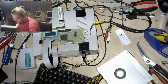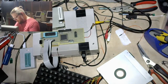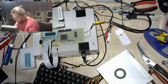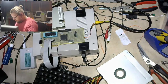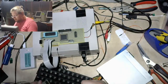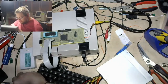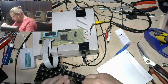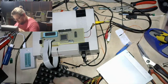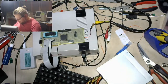God knows how long, because if you're not in a clean room environment, you are definitely introducing particulates into the interior of the drive, where usually the air is super clean and filtered. But when you have a drive that doesn't work at all, the fact that you can do that, and I hear reports of it lasting decently long enough, is interesting. But anyway, I have some of those, and I don't know if that's the issue with some of the ones that I have, but it's worth a try. Worth at least cracking them open. But I gotta buy a Torx bit set, which I don't have. Of course I would have some Torx bits, but I don't think I have exactly the ones required for that drive.